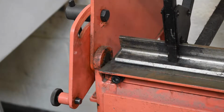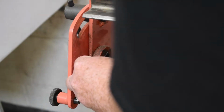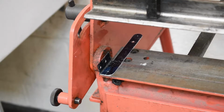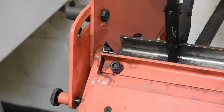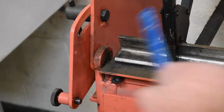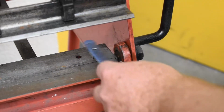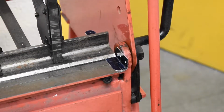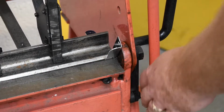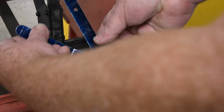Now I'm going to bend the right mudguard on the left hand side of the bending machine. So normal situation, but I'm going to do it over here, right on the edge. So line up, clamp down, and bend that section up at 60 as well. Now I'm going to move over to the right hand side and bend the left mudguard. So here we are on the right hand side, same situation, stick it in right on the edge, line it up carefully, clamp it in place, and we can bend it 60 degrees here. And there we go. So we have these two bent using a little bit of imagination.